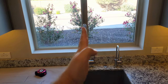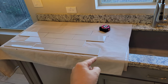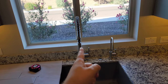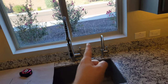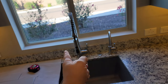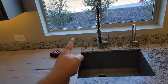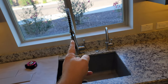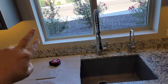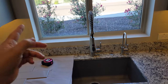The solution is to still center it but adjust. This area is almost 47 inches from here to here. A piece of tile plus grout is 12 inches, so four pieces is about 48 inches — slightly more than 47. The solution is to cut a bit from the two end pieces so they're not 12 inches but 11 and three quarters or 11 and a half — just cut a little from these two pieces, making them equal to each other but smaller than a full tile. The other two middle pieces stay at 12 inches.